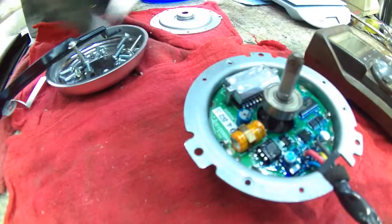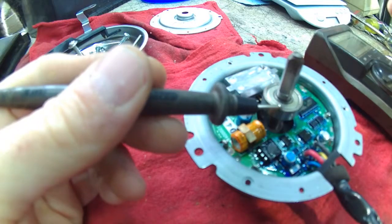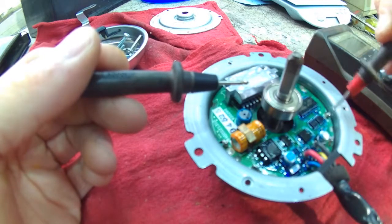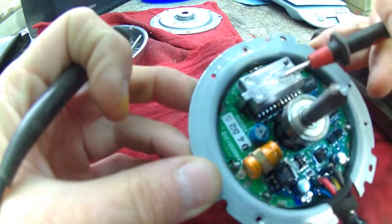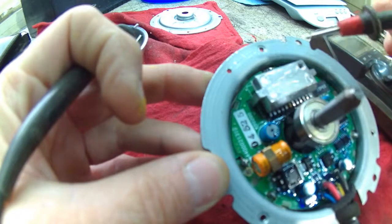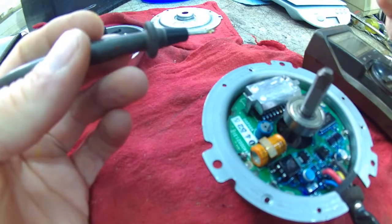I'm not going to show you how to get these fans out because there are a couple of good videos out there, but what we are gonna do is eyeball this motor. These are basically a three-phase brushless motor - you've got the coils on the outside, permanent magnets on the inside, and then basically these are a bunch of MOSFETs and coils underneath this heat sink that trigger the DC voltage between the different coils. There are six leads coming out, so that's basically three-phase, and they're wired in a Y configuration I believe.